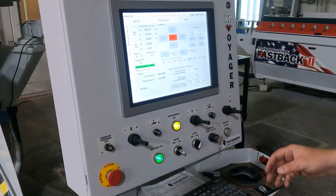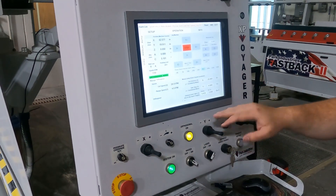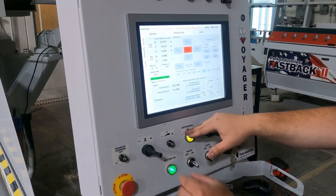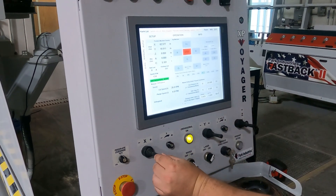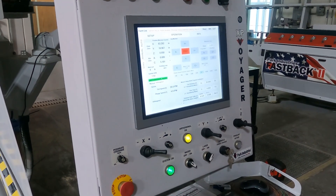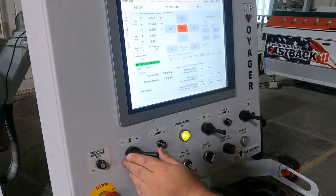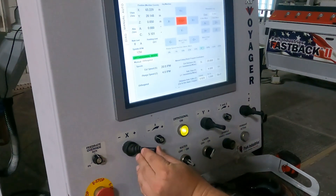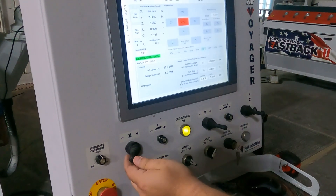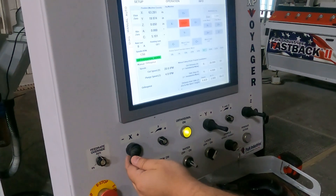What orthogonal mode does is it changes how the machine thinks. Now that I'm in orthogonal, forward on the left toggle switch means that the saw is going to go in the direction that the laser is pointed. This is the direction you want to cut. If you go negative, you will be dragging the blade backwards and the piece might possibly lift while you are cutting.